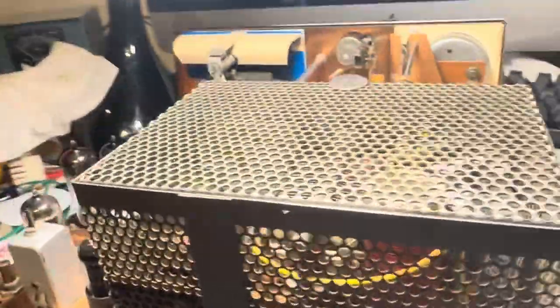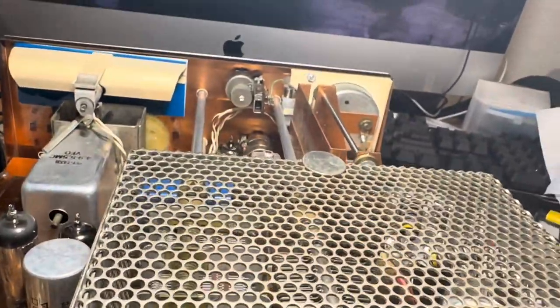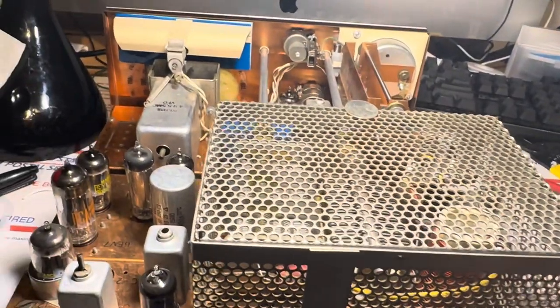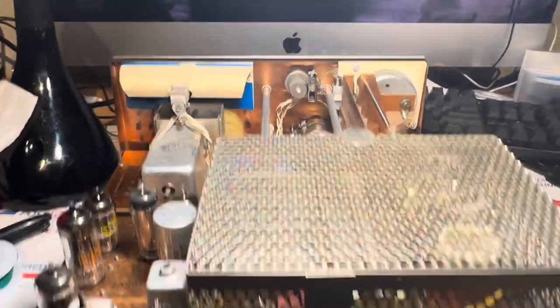It's not working so well with output power though. I'm still dropping a lot of power when I go up in frequency. 80 meters is 100 watts, 40 meters is about 30 or 40 watts, and 20 meters is like 20 watts. So I've got some more problems to sort out — maybe there are some other tubes in here that are bad. We'll figure it out.